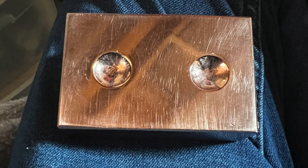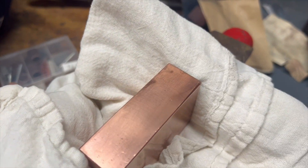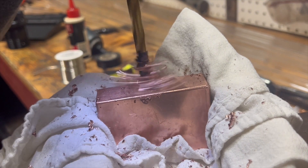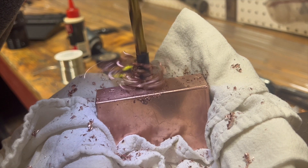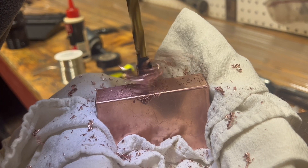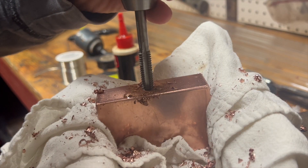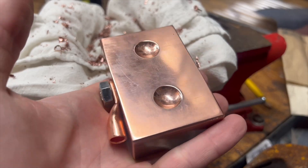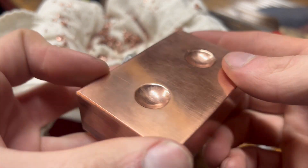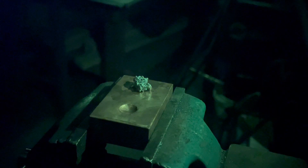The final thing that needed to be machined onto the material was a spot to securely clamp a wire, which will act to complete the circuit. I did this by drilling a hole. Remember when drilling tap holes to drill slightly deeper than needed, because the tap has a tapered front end that doesn't actually make threads. Once drilled out, I tapped it with a tap and die. With that done I was able to connect my connection. I did set up a way to cool the copper block but it didn't pump enough water through it, so I need a larger heat sink — it works temporarily but I want to improve that in the future. For testing I just cooled it off in water between runs.